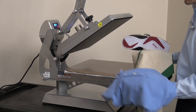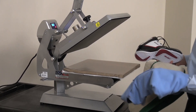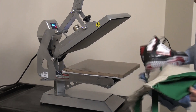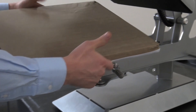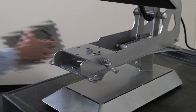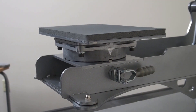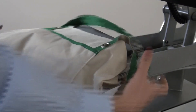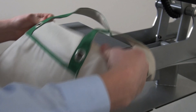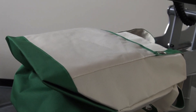Now in the case of odd shaped items or tough-to-do locations that won't split and thread onto the standard size platen, the Hotronix Auto Open Clam features easy changeable bottom platens. A quick pull of the latch and you can easily change the standard platen that comes loaded on the heat press in exchange for another that's the right size to print the items you'd like to print — still threading the item on, making sure all grommets, buttons, seams, and zippers are hanging off the edge of the platen, getting a complete print-ready flat surface.